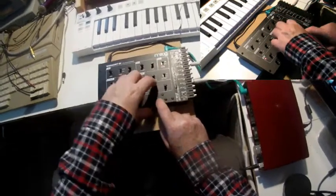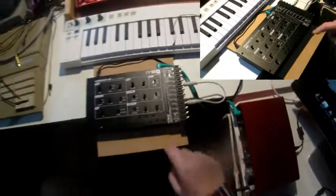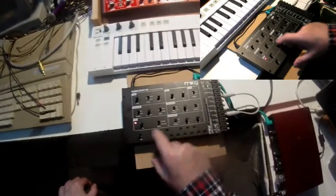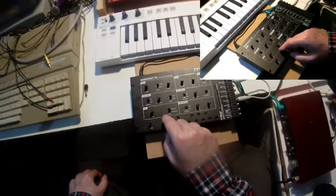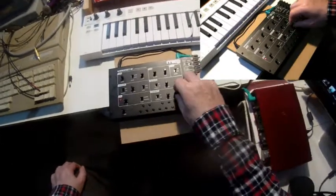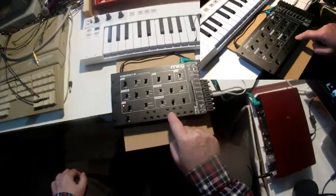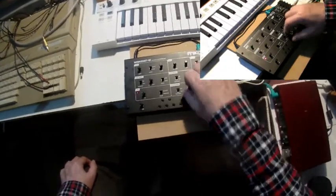Let's use more decay. LFO in, yes, and envelope generator out, yes, right. Also, okay, the LFO should have an effect, otherwise we cannot hear it. Let me use the frequency of the VCO as a modulation target. Yes. And you hear at the beginning it's high, and then according to decay it goes down. Or the other way around.